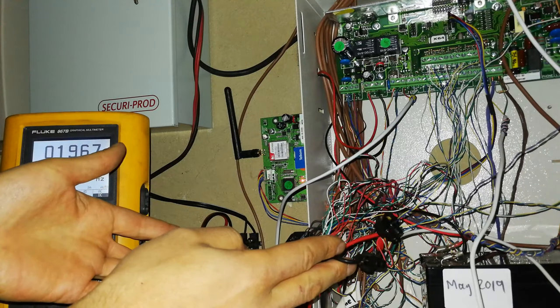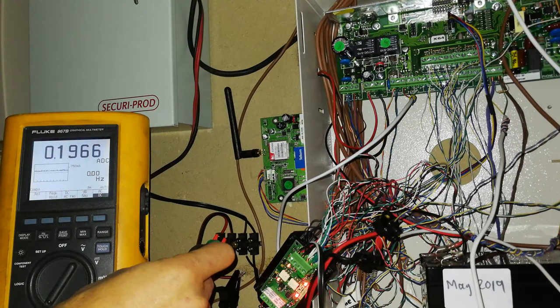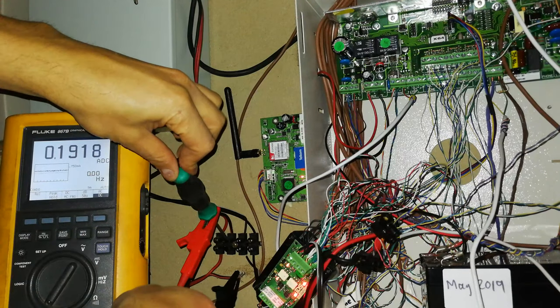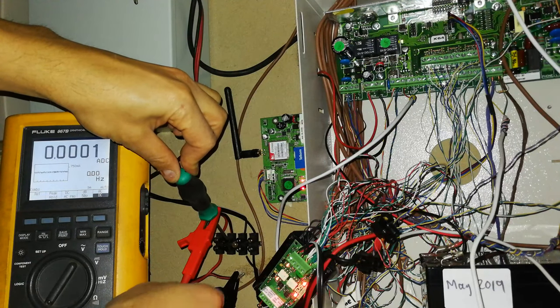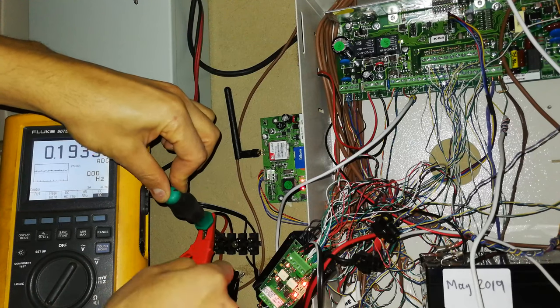These are the sensors - the positive and negative of each sensor are all being fed from an independent power supply, which already relieves the battery of additional loading. This is only 0.2 amps but it's actually much higher when you include the loading from keypads and other devices. In terms of how I've set this up - I'm doing this in series, I've opened the circuit and put a screwdriver here just to maintain the series circuit. You can see the 0.2 amps.